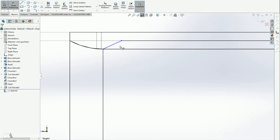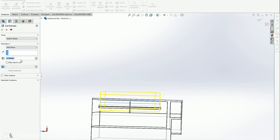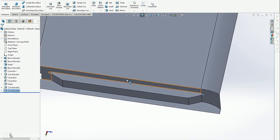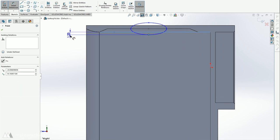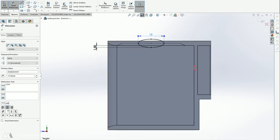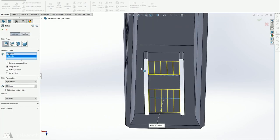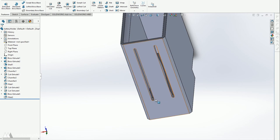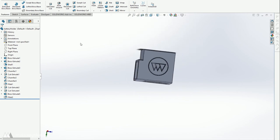I thought I should build a little tab to apply pressure to the battery pack to hold it in place. I created two slots nearly the length of the entire bottom of the battery holder and cut those out to create a panel in the center that can flex a bit. I drew on the right plane cutting through the middle, created a shape to cut from the center panel to make it thinner and more flexible, then extruded a bump that makes contact with the battery pack — the pack flexes it out of the way, creating tension. I filleted that out to make it smooth so the battery pack slides in and stays in place.